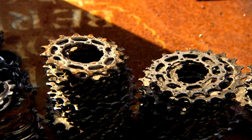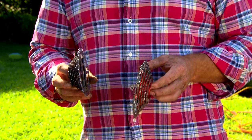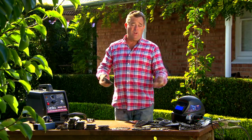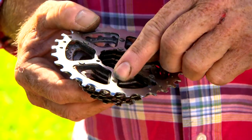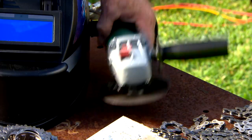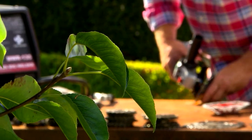You can save a lot of time if you pick up individual cogs. That comes off the back wheel of probably a mountain bike or a racer and they're called cassettes. They're really well made because they've got to put up with people like me sitting on them, so it's all riveted together. To break it apart to make individual cogs you need to grind off each individual rivet and tap them out one at a time.